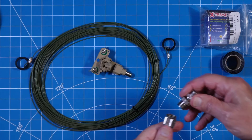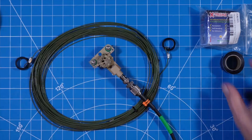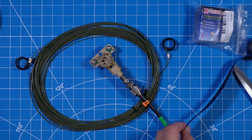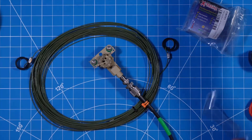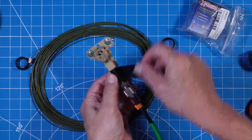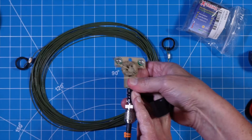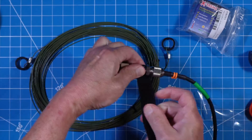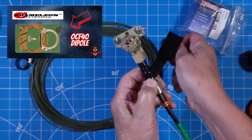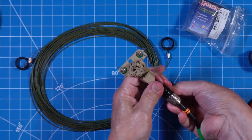And I'm going to share one of those ideas with you today. For my test, I'm using an off-center-fed dipole from Chameleon Antenna. You can use anybody's off-center-fed dipole, or make your own. I don't intend to leave this up long term — this is just an illustration of something you could potentially do. But before I put this up on my ridge vent, attaching the wire with zip ties so that it just disappears, I'm weatherproofing this. It's going to be up there getting some rain in some storms and I don't want water in my coax. I did a review on this antenna several months back. It's a very good performing, low noise, low SWR antenna that I was extraordinarily happy with. It's a great antenna for portable operations.